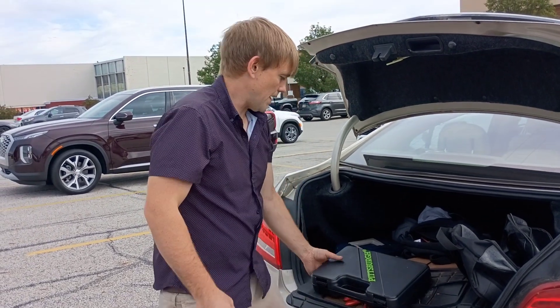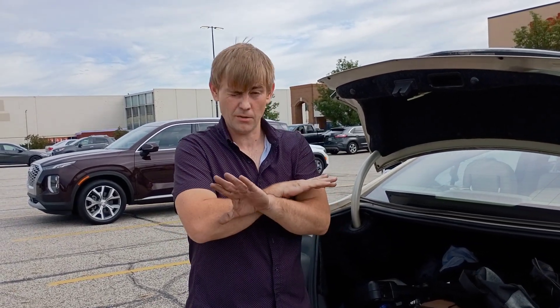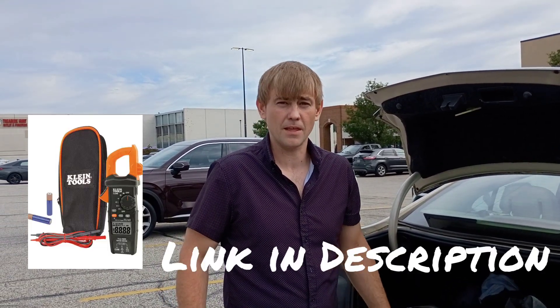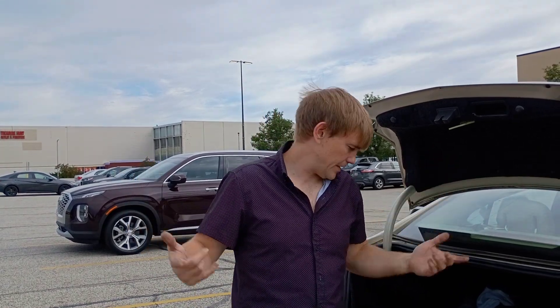Just to reiterate: your main tools are a small flat blade, large flat blade, small crescent wrench, and wire strippers. If you have those, you're going to be able to do 90% of the work. Get a nice multimeter — most companies will buy your multimeter for you, but if they don't, I would suggest Klein brand. Klein is a good, affordable but dependable brand. You want to have an amp clamp on that meter. Get some Allen keys and you should be good to go. That's my tool loadout.